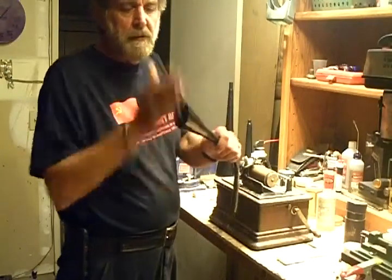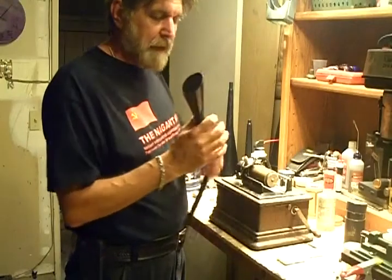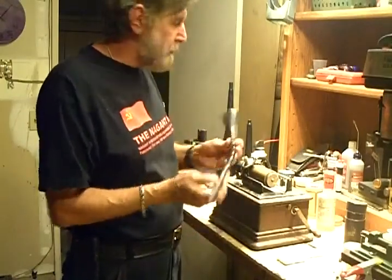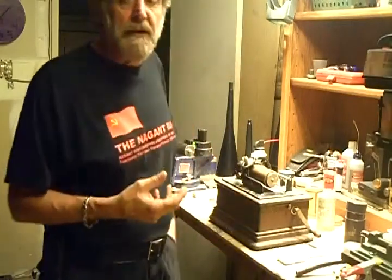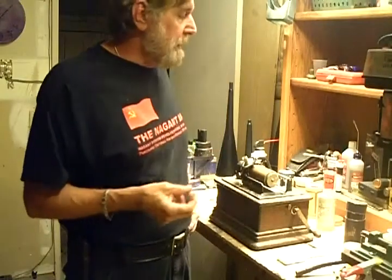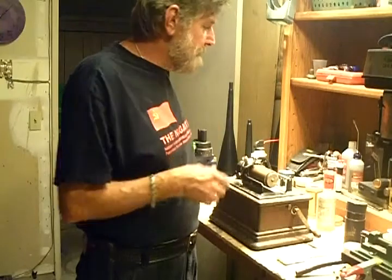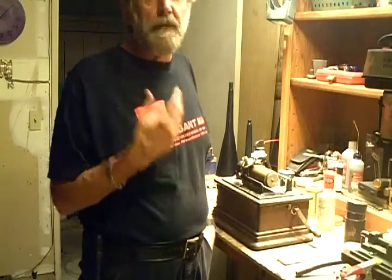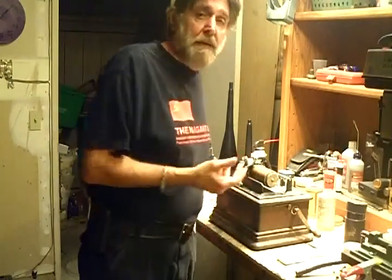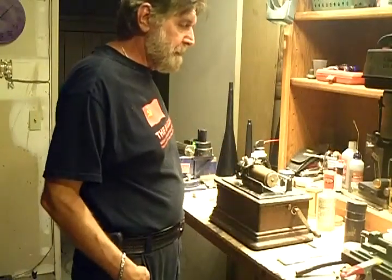The speaking tube, as you can see, has been cut at an angle and it fits directly over your mouth, which allows you to concentrate all of that air pressure directly down to the diaphragm onto the recorder. When you're speaking, you can really hear that diaphragm buzzing — which is what you want. You really want to modulate that diaphragm on the recorder, because the cutting stylus is glued directly to it. So the more vibration you can transfer to it, the better your recording. In this case we're limited by the brown wax cylinder, but it was still a good test of the speaking tube itself.